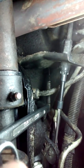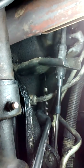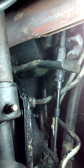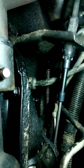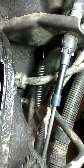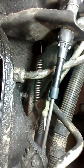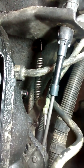Once you break the lock nut and tighten it down to 72 inch-pounds and back off 2 and a quarter turns, slip the offset wrench over like this. You'll still have your screwdriver attachment, so put the offset wrench on first and then the screwdriver attachment. With one hand hold the screw steady, and with the other hand manually tighten down the lock nut. Get it as snug as you can, then put the torque wrench on - when I moved it, it didn't move at all. I put a mark of nail polish on the screw, cleaned the top with rubbing alcohol first, then applied a dab and used a heat gun to dry it quickly. It took a lot of abuse and stayed right on there, which is really helpful to let you know if you've turned that thing as you're doing stuff.